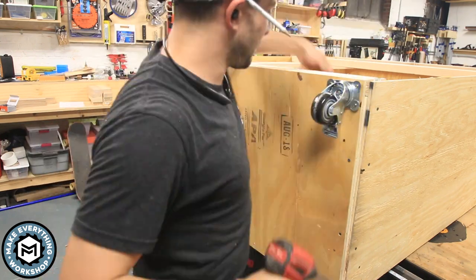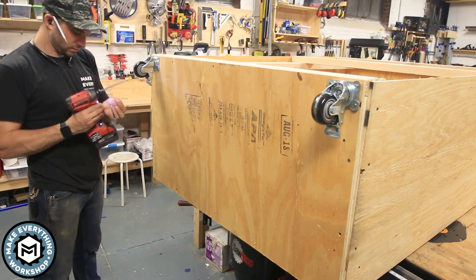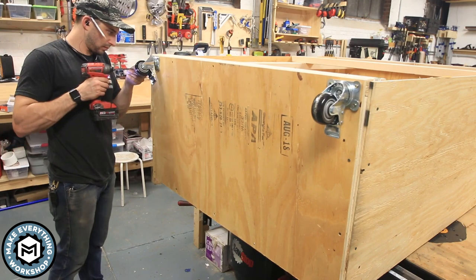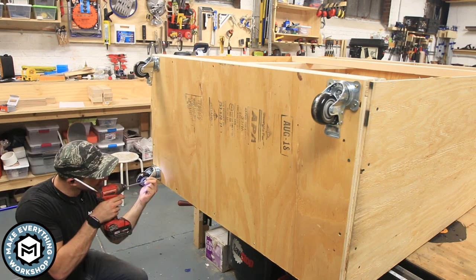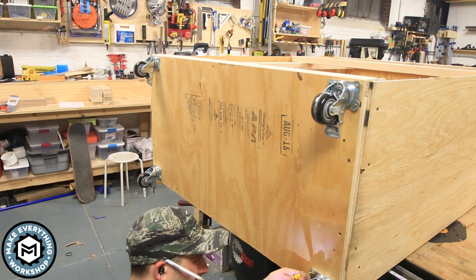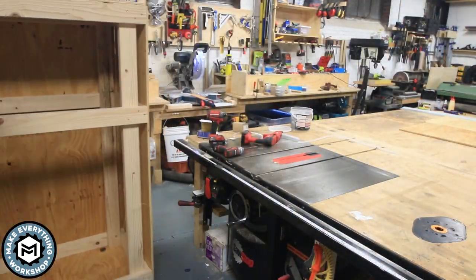Now I wind up having to take those wheels back off and plywood the bottom so that I have a shelf for the kegs to rest on. I decided to switch to two-and-a-half-inch decking screws with fender washers to make sure that if these things had a lot of weight on them, the screws weren't going to rip out. I really trust decking screws laterally and don't have to worry about them breaking.